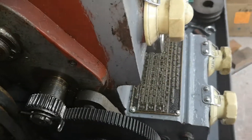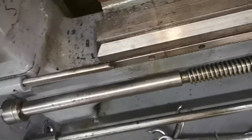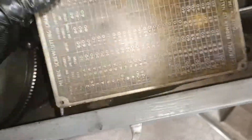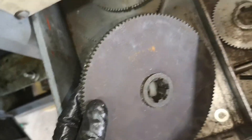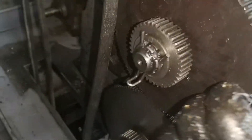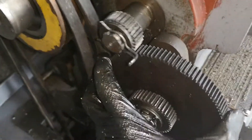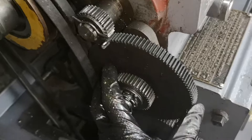I've realised none of my tools work on this. I knew it was imperial, so everything's in inches — fractions of inches — which I can cope with, for threads per inch and stuff like that. There is a table here for change wheels for doing metric. Some of the gears have got a few teeth missing, but somebody seems to have fabricated some replacement gears that look like fibre of some kind — pretty good. That probably explains why one is a little bit wobbly. You can get replacements anyway; it's not a problem.